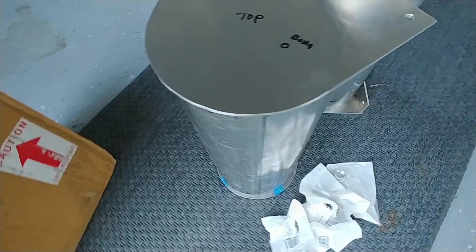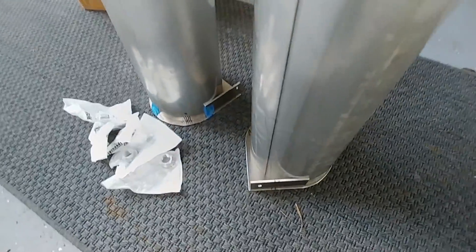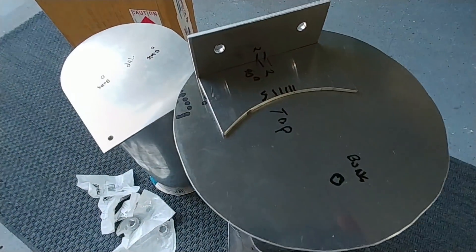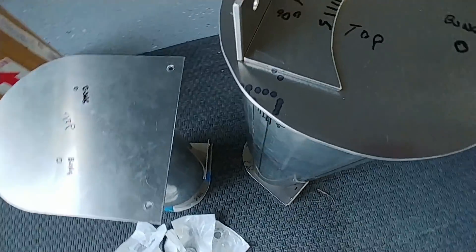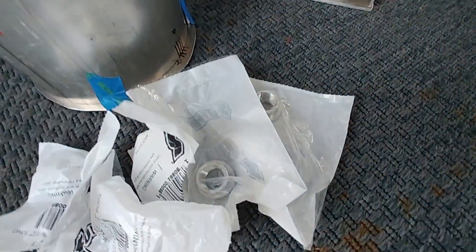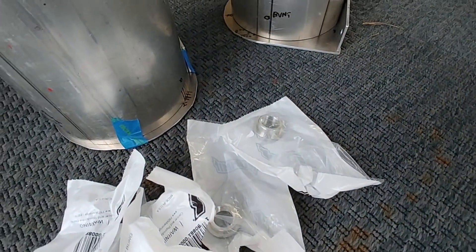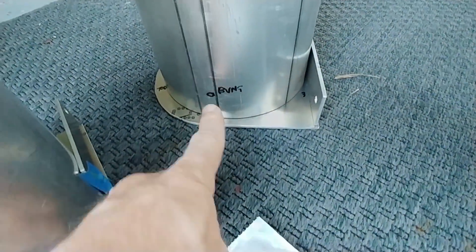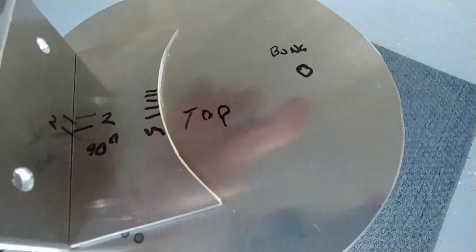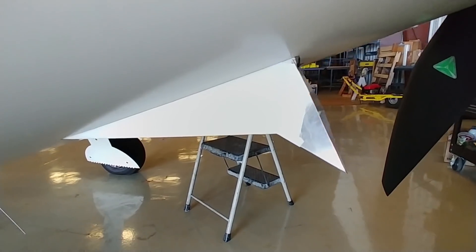In the meantime I'm still working on other projects. These are the aluminum pieces — all one-eighth of an inch thick — for the two tanks I'm making that are going to be up in the nose. I cut all those pieces, which took a while. I've got access to the machine shop at True Flight, which is great. Everything's been taken off to the welder now. Dealing with a new welder, I don't have the luxury of Brit being able to do this for me, so it'll probably be at least a week before I get the parts back. I'm pointing out where the weld bungs will go for the fittings, and I'll also be getting an expansion tank to allow for extra expansion.